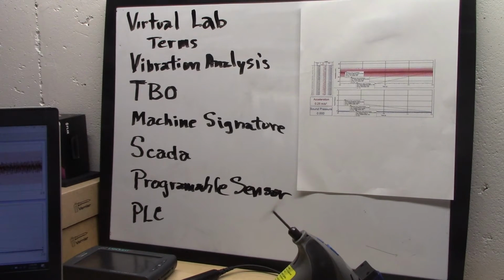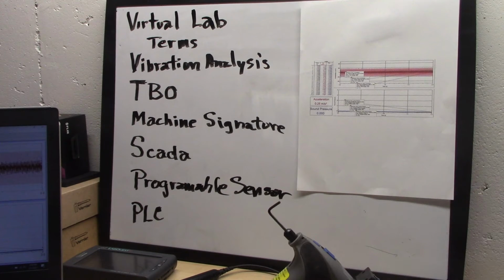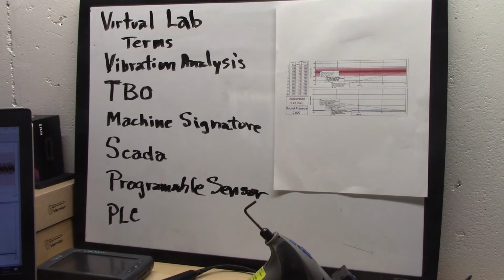Today we're doing a lab on vibration analysis, another virtual blended lab during the COVID season here. And I'm going to turn this off a little at the moment. You'll notice that it puts a vibration out because we purposely put an off-center tool on that Dremel unit. And we use the Dremel because it's a common item, and it's also capable of running at about 20,000 RPM.